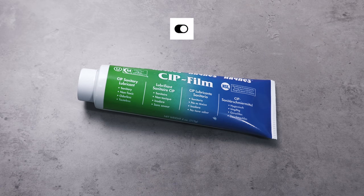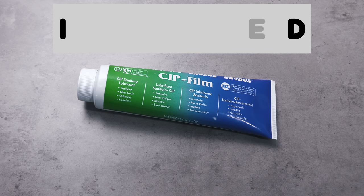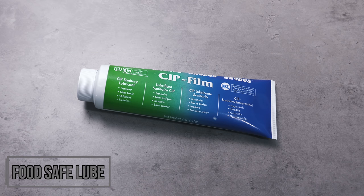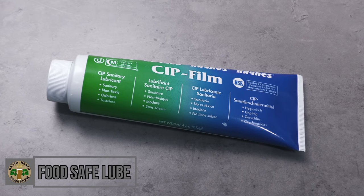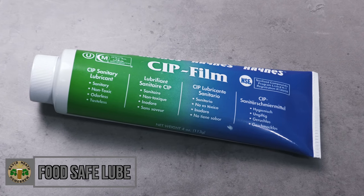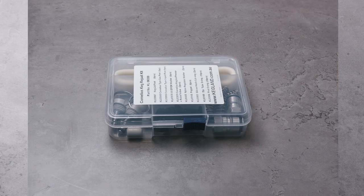Firstly, here is a quick guide as to what you will need for this maintenance. As you can already see, you will need a tube of food safe lubricant. These can also be marked as sanitary. This lubricant is used on our seals. Not only does this enable the seals to obtain a better bond, it also protects them giving them a longer life. This cheap and easy to use stuff can often be the difference between a leak and a CO2 tight system. Do not underestimate it.